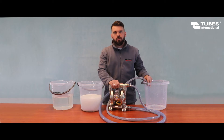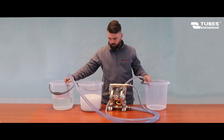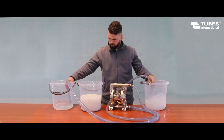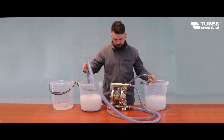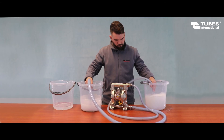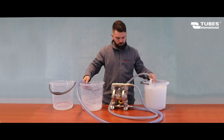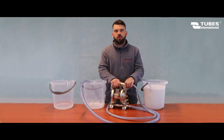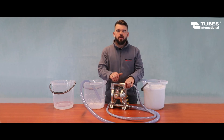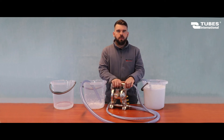The pump is pumping the fluid with a pressure equal to the compressed air pressure. Now I will check how it copes with the thicker substance. These pumps are used for pumping a wide variety of fluids, including high-viscosity fluids. They are ideal for chemical, petrochemical, waste oils, waste water, solvents, or varnish applications. Remember that all pumps can only be used for fluids with a flash point above 55 degrees Celsius.